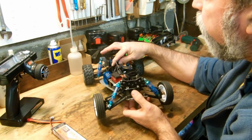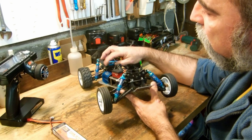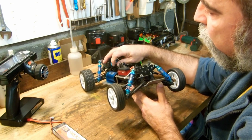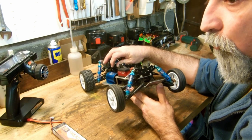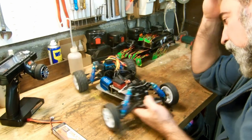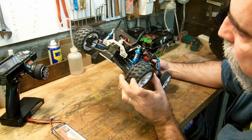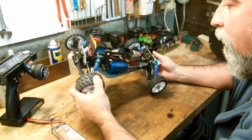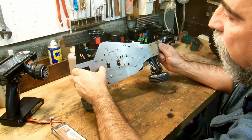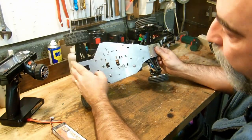I'll see if I can try to repair that broken tooth — re-make a tooth. I used a product once on one of my motorbikes where you mix two pastes and it makes something very hard — you can even drill it, it's quite tough. But I'm not sure the material will stick to it. So I'll put a larger pinion — the problem is I may not have enough adjustment room to move the motor back. I could make holes further out to move it back. I could modify that too — but no, I'd need to spread it wider and I'm already at the furthest position, so that's not possible.